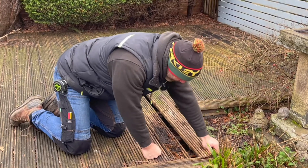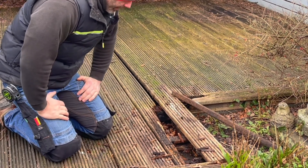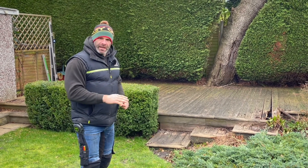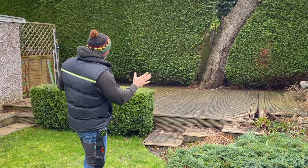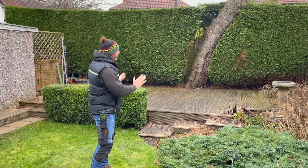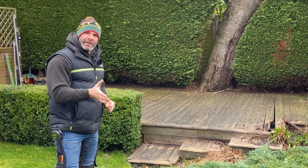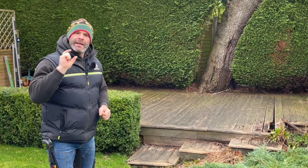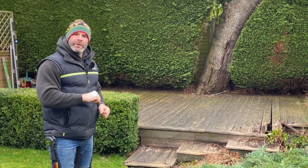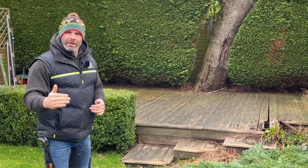It is definitely ready for a bit of work. I was invited out to meet these clients partway through last year and they explained to me that this deck had been implemented somewhere between 10 and 15 years ago. They very much enjoyed using it — it provides a great entertainment space. They don't want to replace it with an alternative surface finish such as paving; they do want to keep it as decking but they definitely want to introduce as much longevity as possible. So I suggested a composite deck coupled with composite framing, and as I said there is no timber, so in terms of lifespan we've absolutely maximized that.